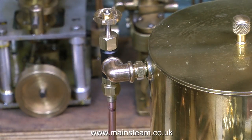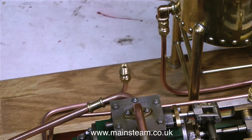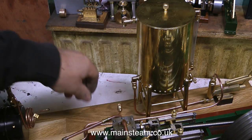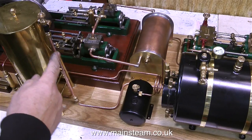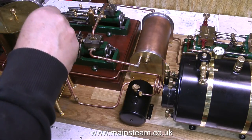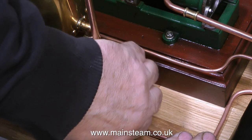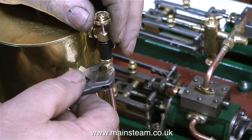Here is the aforementioned water bypass valve, and I've fitted this to the tank for a reason. It's not a good idea having it down in the middle of the plant because you could burn your fingers, trap your fingers in the flywheel or in the pump or even in the motion of the steam engine. So the best place to put this bypass valve is right on top of the tank where you can get at it very easily. I really wasn't happy with a one-piece pipe feed to this tank because it's very unrealistic to have a piece of copper pipe that length. So I fitted an inline double union, and I think it looks better — it's in the right place just to support the vertical pipe that goes to the bypass valve.